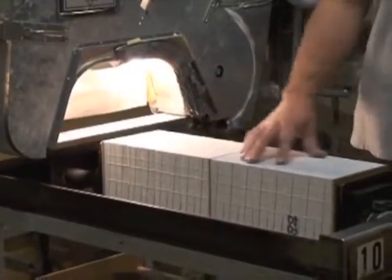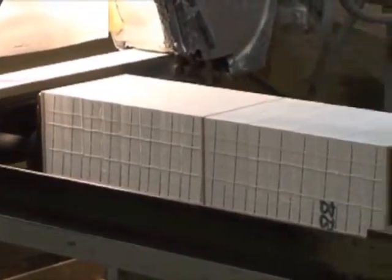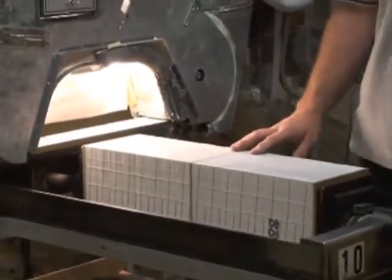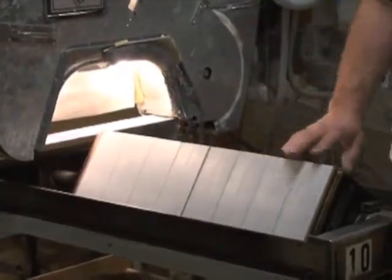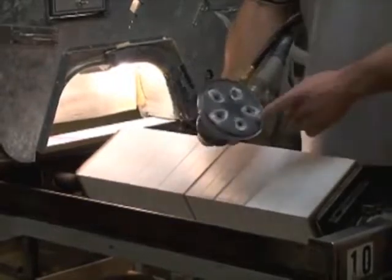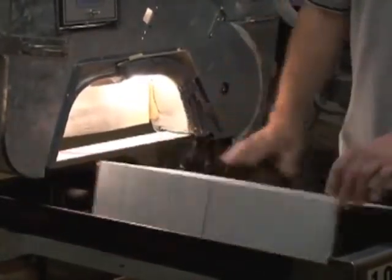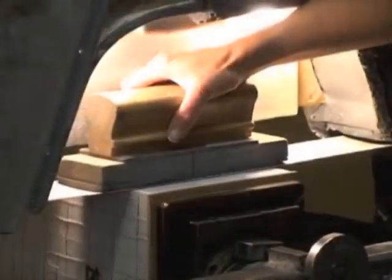In this next step we sand all three sides with 100-grit sandpaper to take all the rough edges off. Then we switch the belts and go to 150-grit sandpaper, once again doing all three sides. Next we round the corners over — which are square now, but your Bible has rounded corners. We do this using a quarter-inch round-over and a router, then sand with an orbital sander. We finish the process by sanding the corners with 220-grit sandpaper, then use 150, 220, and 320-grit sandpaper on the flat sides to smooth them, leaving the Bible ready for gold edging.